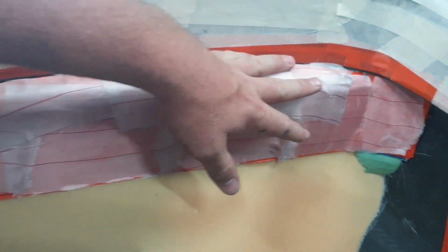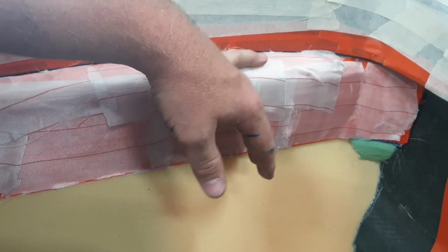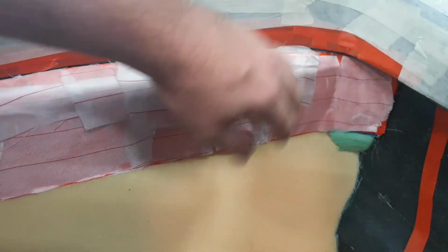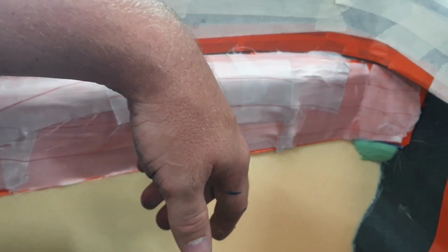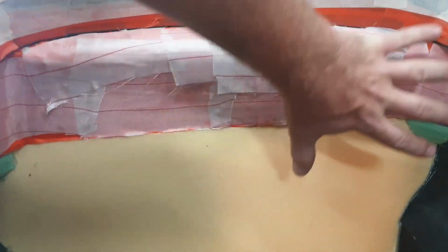We'll do about 5 or 6 layers of carbon, about 2 layers of Kevlar, and we're going to be using a few layers of the woven titanium carbon, and that will be ultra strong for this area here. And then once this is done, this whole section will be completely bonded inside here, but this back section here will actually pop out, so we'll pull this section out.